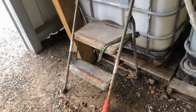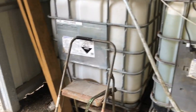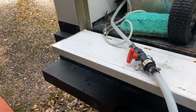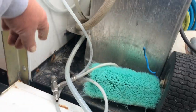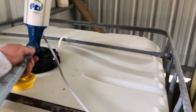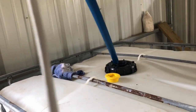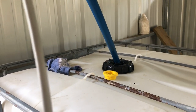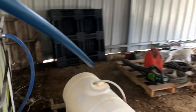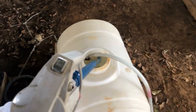We just emptied this one the other day — we had a bank job to do. That one's empty, this one's full. The drop stick goes all the way to the bottom, and then we just flip it on and it'll start pumping right through that hose. I come over here, turn the ball valve on, and it'll pump just like I was describing with the air diaphragm. Once I'm done, I turn the pump off, pull it up, and hold it right like that to let it drain out of the drop tube and get some going down the hose. Then I take it over here and stick it into the tank of water and turn it back on to get a little water going through it.